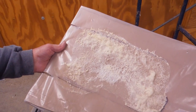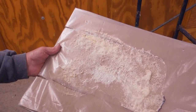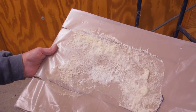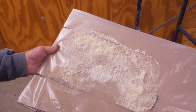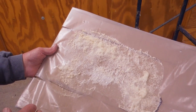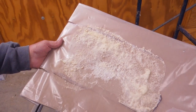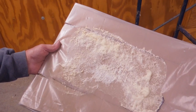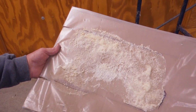You have to work fairly fast with this. One of the problems is that the foam requires moisture in order to cure. While it was able to get some moisture from the air, once this foam got onto the plastic it self-sealed from the atmosphere and couldn't cure out anymore. That's why it was that sticky gooey mess, and it didn't foam as nicely as would have been preferred. So I had to go in and do some repairs.